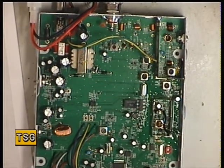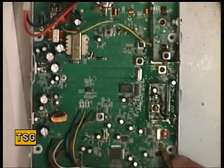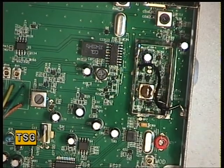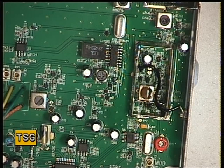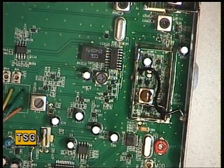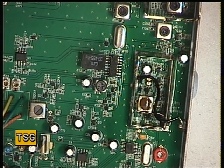We'll now do the deviation. The transmitter deviation is adjusted at RV5, which is down there. I'll zoom in on that for you. We'll make sure we're set up for this, and get the little tone oscillator on the job. Let's see where the deviation is reading.